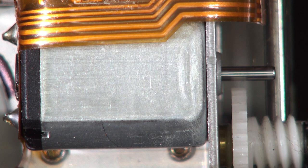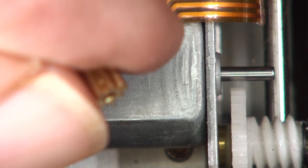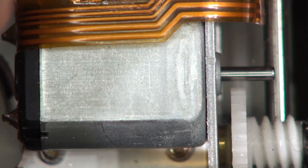On the shaft there is a tiny little acetal gear, and it cracks open and breaks — no good at all. I said in my last video four years ago that I would get some gears, but when I went to get them they're not a standard gear. Trust good old Bose — they've decided to make it a custom gear just to make it more difficult. It's a very hard-to-get imperial gear and nobody makes them anymore, but with the right amount of money, a drawing, and a bit of calculation you can get them made.